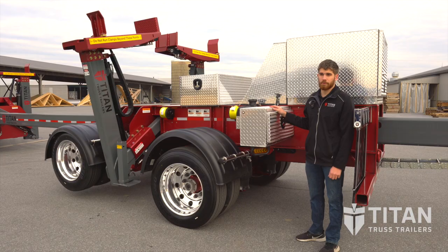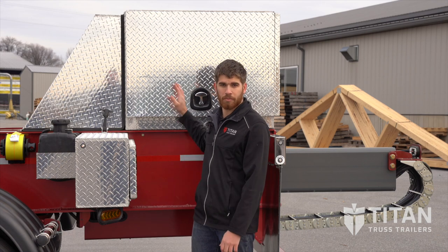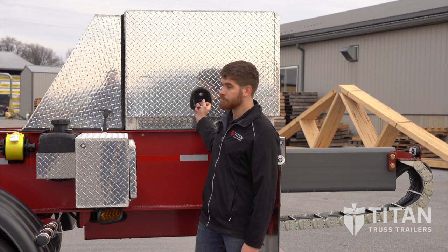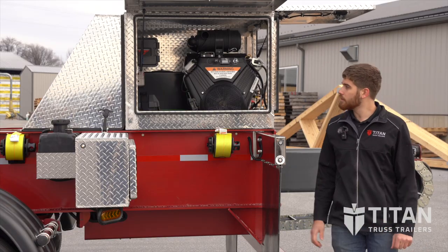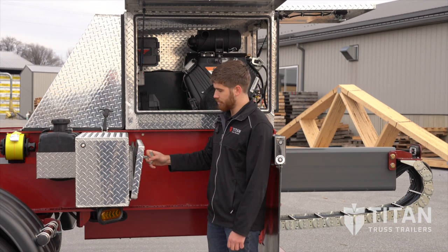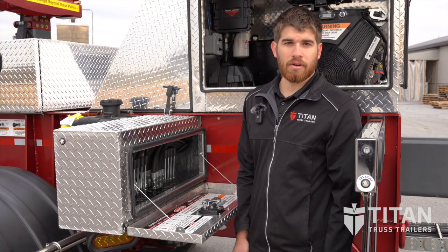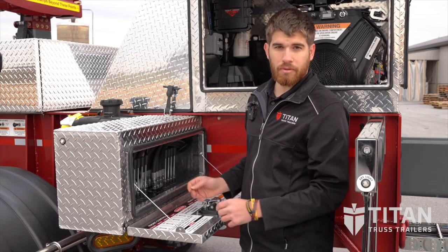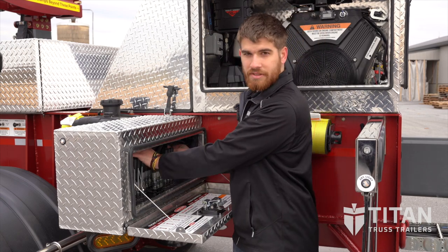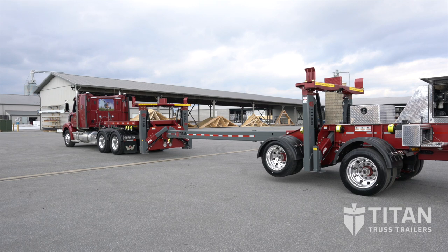This is the control panel for all your controls on this side of the trailer. This is the engine compartment that has the engine for starting. In order to start the engine you have to open both doors on this toolbox. After you've started your engine you can open the hydraulic compartment and all your controls for this side of the trailer are right in here. In order to get the arms in the upright position you have to pull these two levers. In order to open the clamps slowly you have to push these two levers.